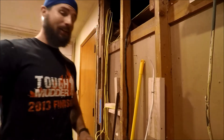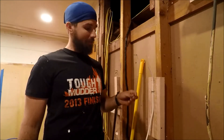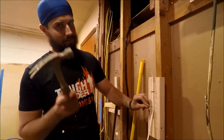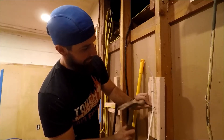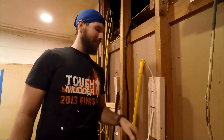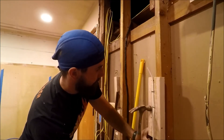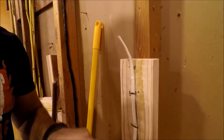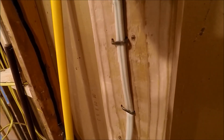As you can see, the correctly stapled wire slides up and down beautifully. What you don't want to do is take your staple and put it through the wire — that's a bad idea — and do something called overdriving. This is what an overdriven staple looks like: it comes through and it pinches all the way through the protection and guards on the wire.